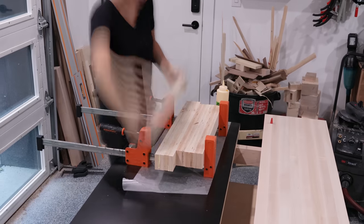The gap stop is taller than the workbench top, so it needs to be notched out where it hits the base aprons. Using a combo square I get the notch depth, and it's already so fun to use this vise to cut them up and use the dog holes to hold down the work pieces. One final pass with a template bit in a router to bring to final depth, chamfer those corners, and it slides right onto the aprons perfectly flush with the tops.